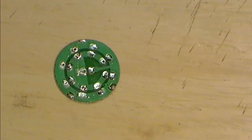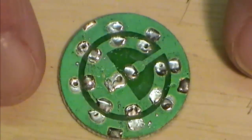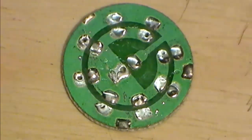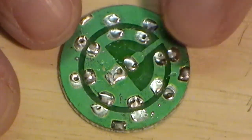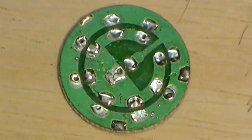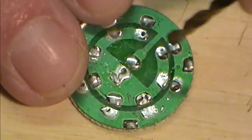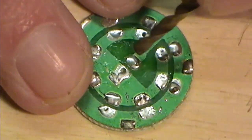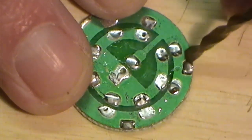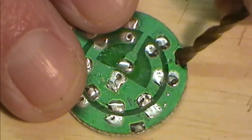You can either stick your LEDs to one side, save them for another day, or bin them. Shouldn't be saying that. We should be recycling. What I'm going to do now with this board, and you'll probably see if I go down a little bit further, on this board here, where you had your pos and your negs running round the LEDs, you've got a ring here which runs all the way around the outside, and you've got a little centre post here that pops up. So this ring running round pops up on that middle bit to another pin which joins your spring, your plus and your minus. This one doesn't join them, but your middle LED will be running across there. These outer points here are what actually earth this board to the inside of the torch. So this will give you your earth feed. Now we're not particularly worried about those.